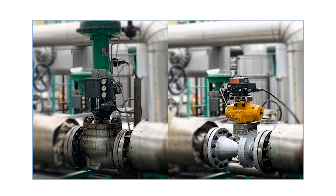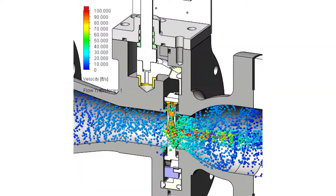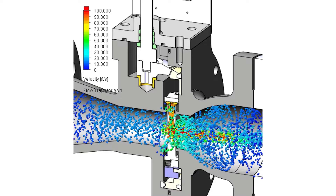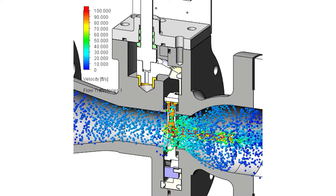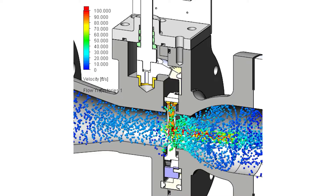As you can see from the side-by-side comparison, an automated Clark valve can be a much more compact package than a standard globe valve with a diaphragm actuator. Shutoff torque is independent of differential pressure, and that means we know the correct actuator as soon as the valve is selected. The low operational and shutoff torque comes from the discs moving perpendicular to and not against the flow path.